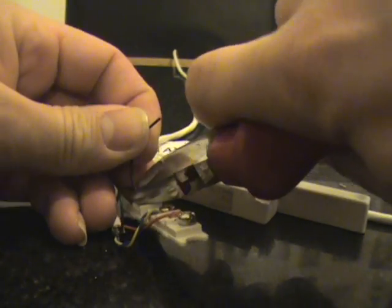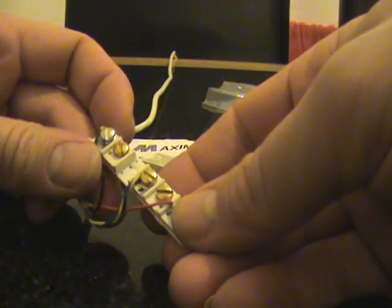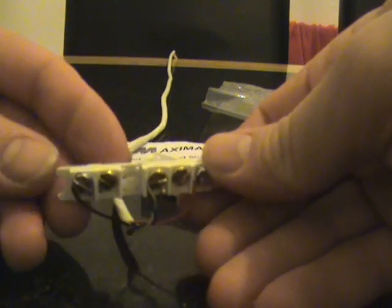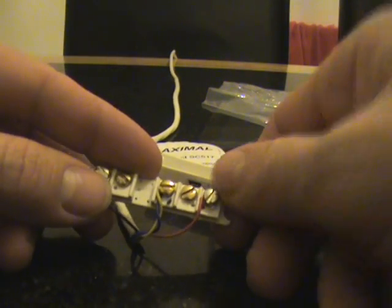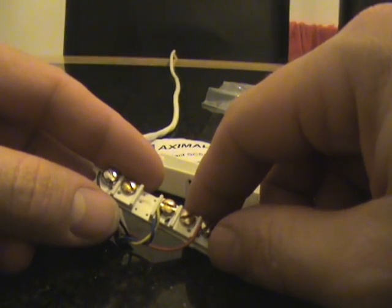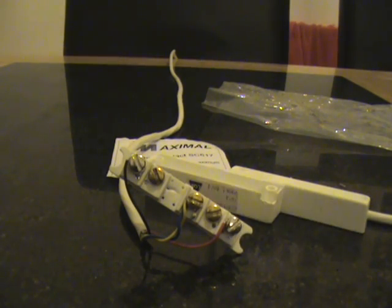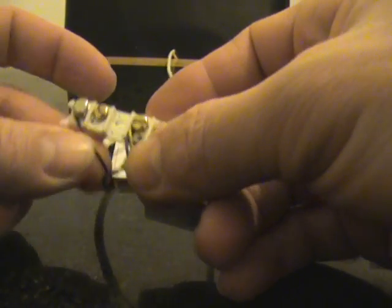I have used these colours for the purpose of this demonstration but if your installer has used different colours you are going to have to interpret that yourself to see what you would have on these end terminals here — the most important bits. If you have an older system you might find the installer might not have actually used tamper, so you might find you only have the two wires here for the contact for when the door is open or closed.